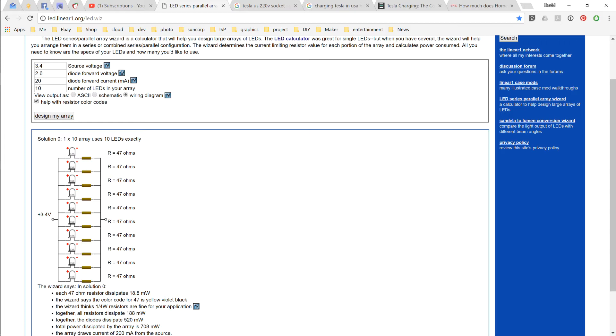Here I was using two 1.5 volt batteries that when new put out about 1.6 to 1.7 volts each, so that's putting a value of 3.4 for the two of them. I was using some white LEDs and my particular ones had a forward voltage of about 2.6 volts, and I wanted to run them at 20 milliamps to get the full brightness out of them while the batteries were strong, and then it would just get dimmer over time.